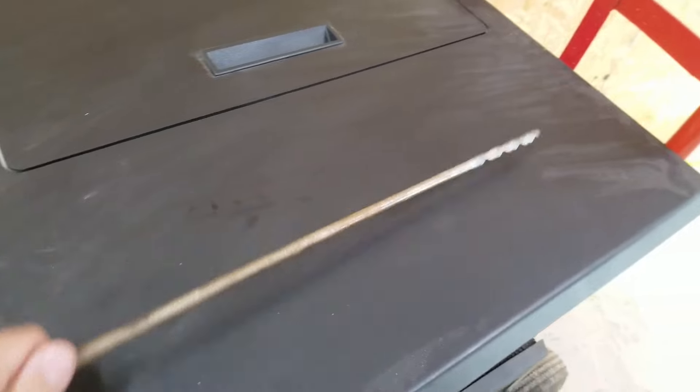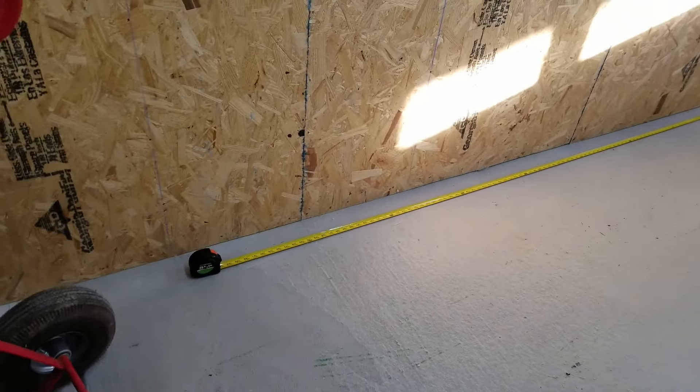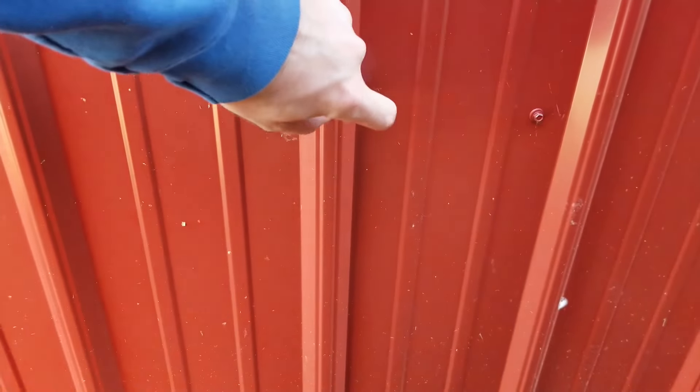The first thing I'm going to do is take this long drill bit and drill through the wall. What I've got to figure out is when I come out with my hole saw, I need to end up between ribs and get on as flat a surface as possible. We don't want the hole to come out in one of these deeper ribs because it would be an absolute pain to try to get it weatherproof.